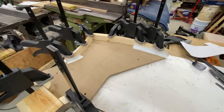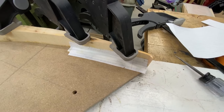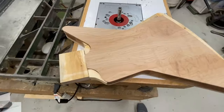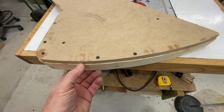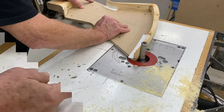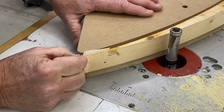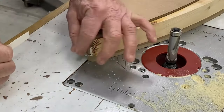The jig's been sitting all night with the clamps on. I put reinforcement into the parts where the wood is real thin and you can't attach anything other than glue — we'll see how it holds up. Here's the body placed into the jig to make sure it still fits. You can see the parts I made that guide the bearing are sticking out past the jig, so I need to trim this off with the router. It's going to get real thin down on this one end, so hopefully it holds up. This thin part was starting to vibrate so I put the template back in and wedged a little piece of paper to keep it tight. It's thin but it turned out okay — I think it's gonna work.